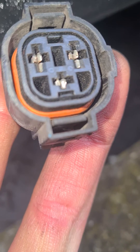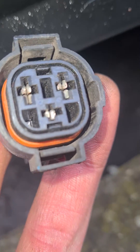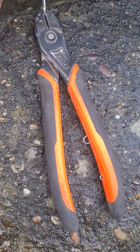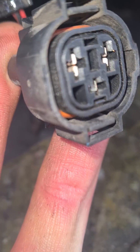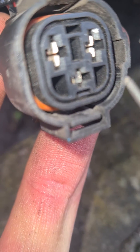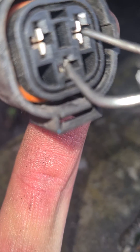So what I'm going to do, just with a simple piece of wire and a pair of insulated cutters, is just drop a link into there and just test the fans. You'll notice when I put them in, the fan will run.